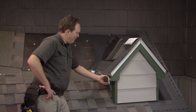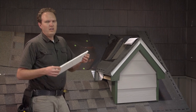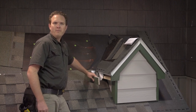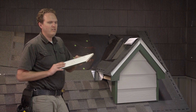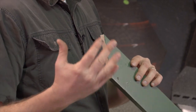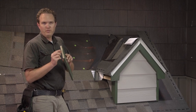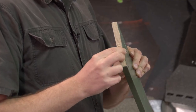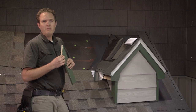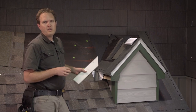A really important detail when putting your fascia board back — and I see this all the time — is that people have the tendency to want to cut their fascia board so it's jammed up against the roof real tight. What you actually want to do is cut this edge of the fascia board back so that it's about an inch off the roof, because this is wood and it's going to absorb moisture. Even if it's HardiePlank, if it's jammed up on the roof it's going to absorb moisture. So leave a gap between the roof and this edge of the fascia board. Chances are if it's an old roof you've already got some rot on this piece, so you may have to trim that back or replace the board before you put it back over your flashing.